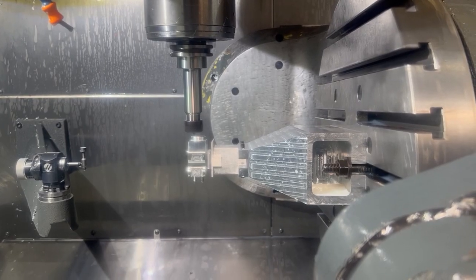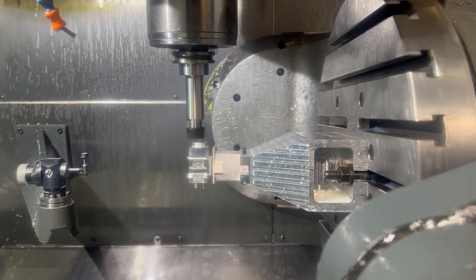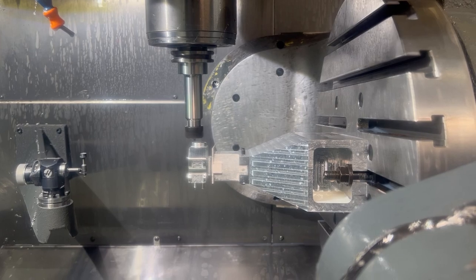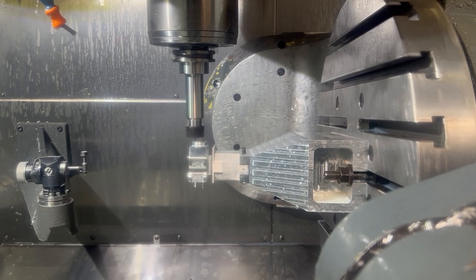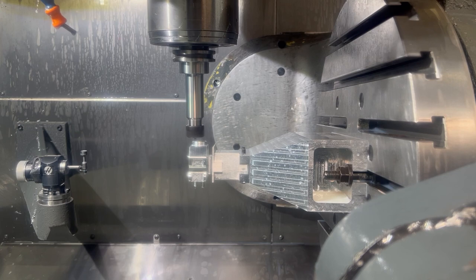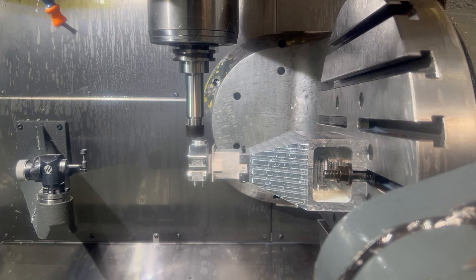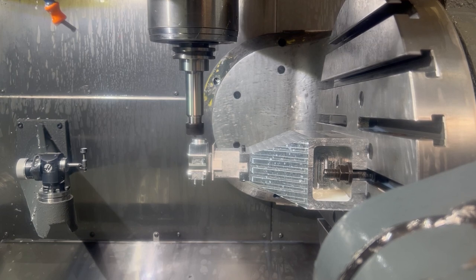So if we look, there's like a crazy angle on the table, which isn't quite square. It's at like a 10 degree angle. And we're sneaking in a very long spindly end mill to cut a countersink using a raster cut. So that horrible screeching sound was like a 3-inch or like a 75 millimeter by 3 millimeter end mill rattling as it's cutting metal.